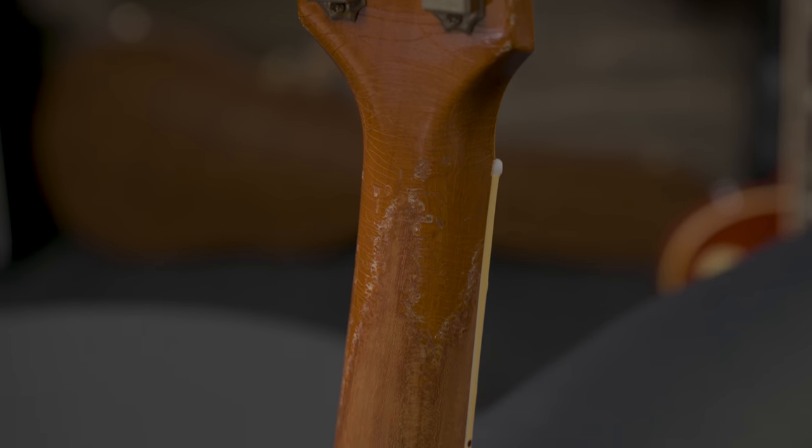Can you show us the back of the neck on that one? It resembles the heavy age, as I was saying. But if you can see, we try to leave some texture in the remaining finish and at the edge of the remaining finish, so it doesn't just look like it was peeled off all the way to the wood. Years ago on the Paul Kossoff guitar, his guitar suffered so much sweat damage that it soaked through the weather checking and just pocked and pitted the entire neck up to where it was broken off and then grafted on. So you see new finish here and the rest of it is just really, really dark and not very comfortable, frankly. Although when he was playing it, it looks like it just flaked off. Some of that is from seeing that, but we don't want it to feel rough.